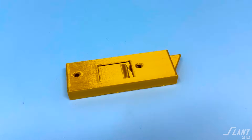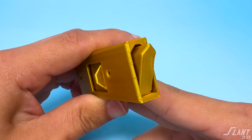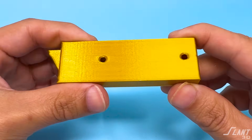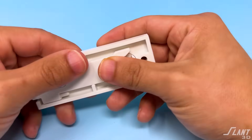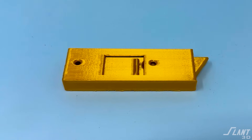If we were to refine this a little bit more, we could change the return, mess around with dimensions, reinforce some features, or apply an outer texture to eliminate layer lines. Overall, this is a good demonstration of how a 3D printed solution can end up being more optimal than an injection molded option — you don't have to deal with the constraints of traditional manufacturing, and you end up making it better, faster, and cheaper. Have a great day everybody.